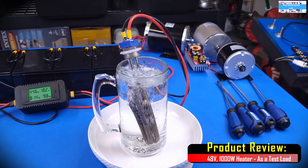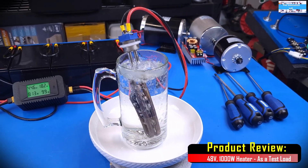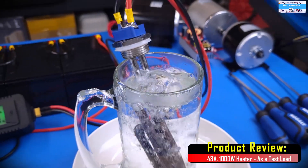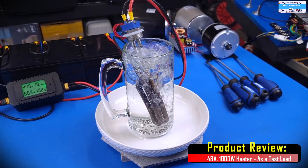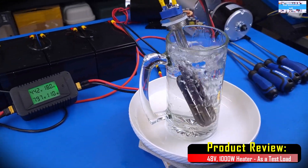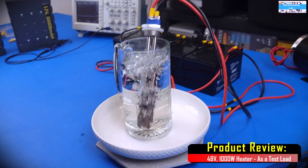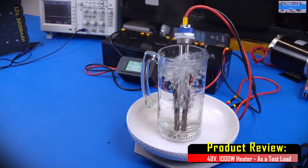All right, my friends, that's it for this video. Thank you for watching. As you have seen in the video, I will say that this is an amazing product. We were able to dissipate about 900 watts using this heater as a load. We were not able to get to 1000 watts because of the voltage drop, and that can also be explained because the battery system that we're using is not designed to handle that much current draw through it. If you'd like to see how we're going to be using this test load in our next video, don't forget to subscribe to the Innovation Lab.